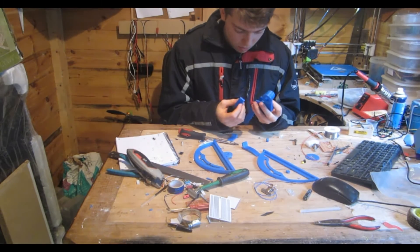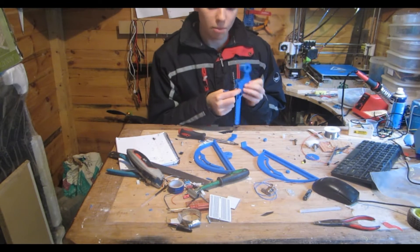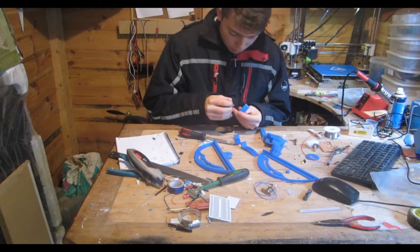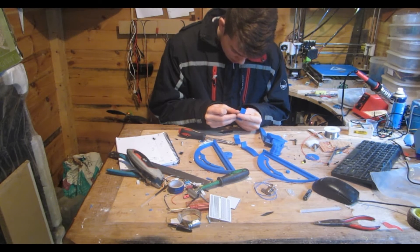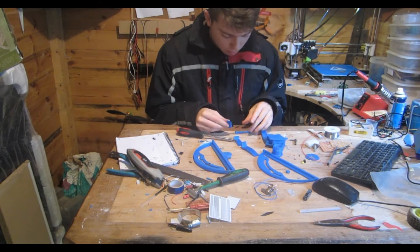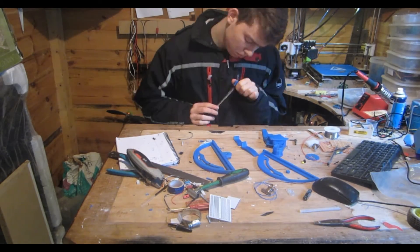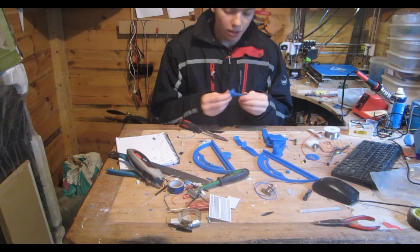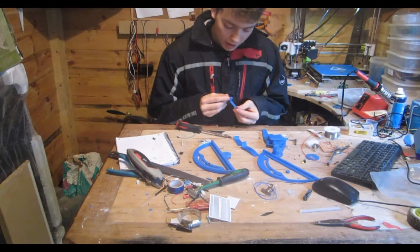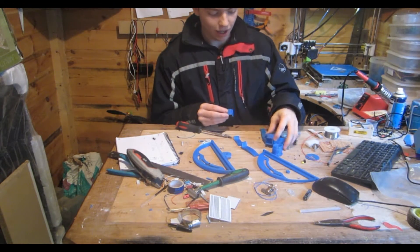One side of this lever mechanism is slightly longer than the other one. The longer side needs to be towards the thicker part of the handle — in this case that's the wrong way around. Now we know the orientation, we can put the short bolt through the handle. You need to make sure that the bolt head is flush with the side of the handle, or you won't be able to operate the handle because it will get jammed.